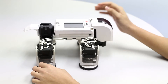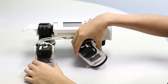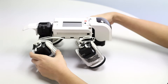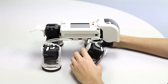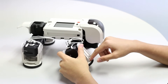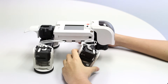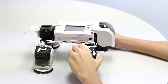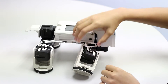I'll show you this on one leg first. This will be the forward position — I'll call this the landing position. It will push backwards, and if all the legs do this at the same time, the robot will push itself forward. After pushing forward, the leg needs to lift from the ground so it won't apply friction, and then move back to the original landing position.